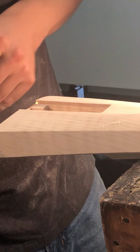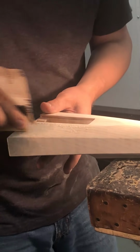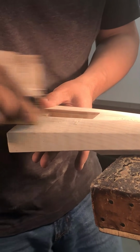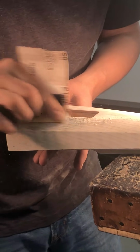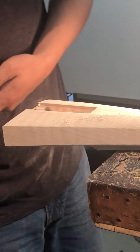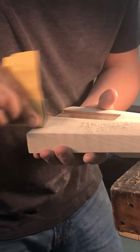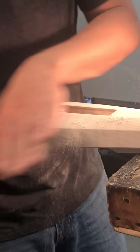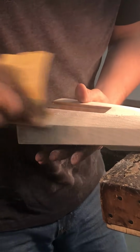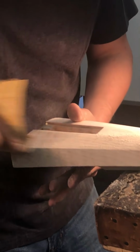After you have an air filtration going most of the time and then not, this dust is really annoying. So working right up to that scribe line, and then also cutting down to the edge of the butt plate, which is basically right there, a tiny bit more. Just started to hit the butt plate. We don't really want to dive it over or anything like that. We want to blend it all back so it maintains the same stock contour.